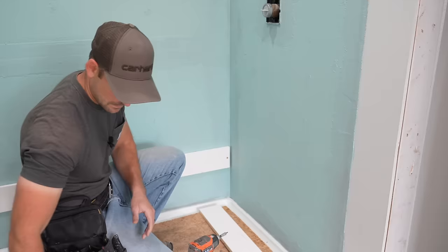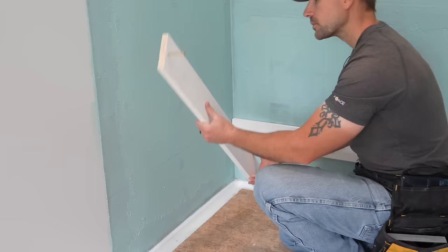When installing these boards I usually use a minimal amount of screws — one on each end should be adequate since they're not supporting that much weight. On the five-foot-long wall I did put one in the middle for extra support.